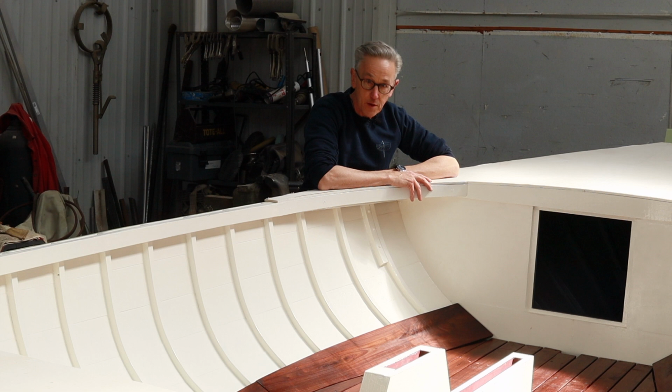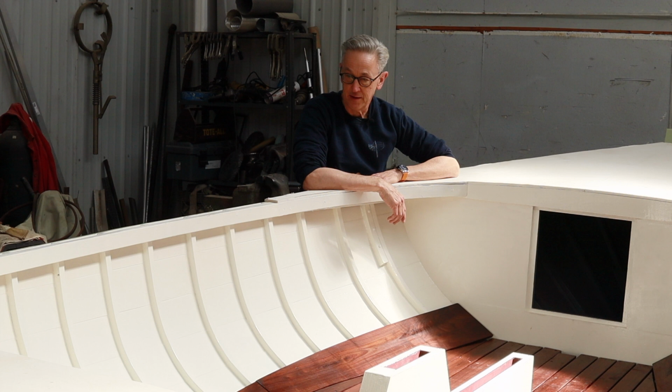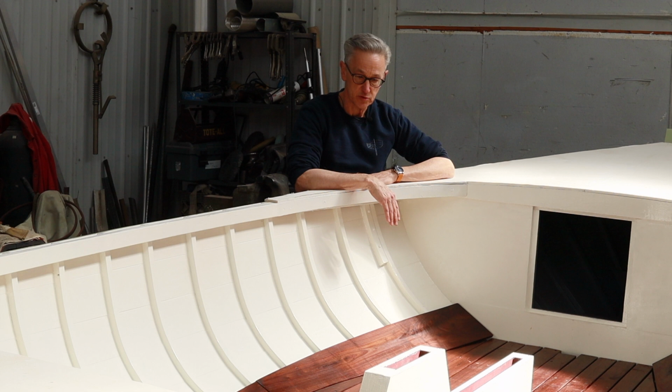Well, I had ordered 150 screws, and what I miscalculated was the number of screws that I was going to need for the margin boards. So I just have those temporarily tacked in, and I'll need to order some more screws so I can get those finished up. Now this deck will all gray out once it's out in the weather, like a lot of wooden decks do on boats. If I don't want it to gray out, then what I'll need to do is to oil it a couple of times each season, and then it'll stay nice and bright.